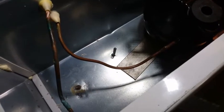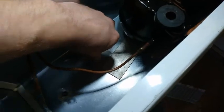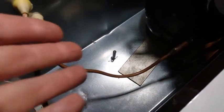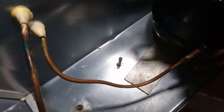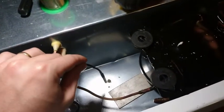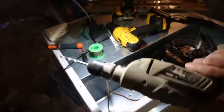Okay, wish me luck. It felt good — it went down quite a way with no resistance, just going through the insulation. I've been twisting it through by hand after making the initial hole through the sheet metal, and I think I'm hitting up against the inside of the food compartment, which is great. Beautiful — an 8mm hole on the underside, perfect, and a 6mm hole through into the freezer compartment. Had to break out the right-angle drill to get the angle down there, but it worked perfectly.